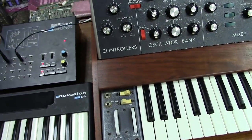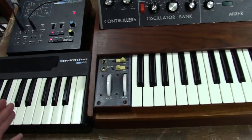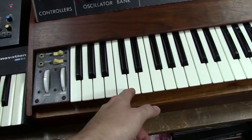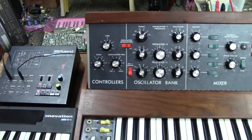And what you would have to do originally when you plug this thing into another synthesizer, we'll use a Polymoog for example, you'd hit the lowest note of the Polymoog, and the lowest note is an E note. So you'd hit the E note of your Minimoog, and then while hitting the lowest note, you'd use your tune knob to tune the low end for zero beating.